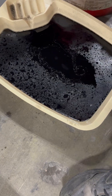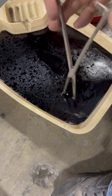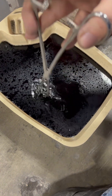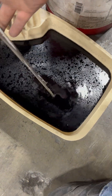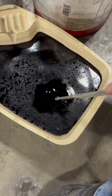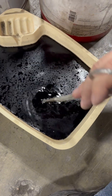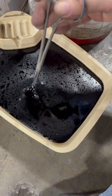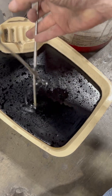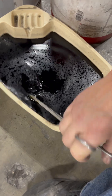It's stripping rather nicely. This is our powder strip on some castings, and it's a low hazard stripper. But it still can de-grease and de-oil your hands, so you shouldn't get your hands in there.